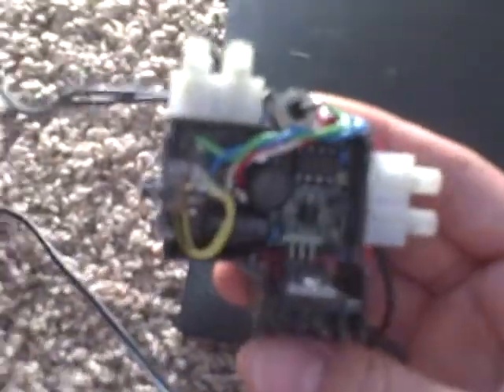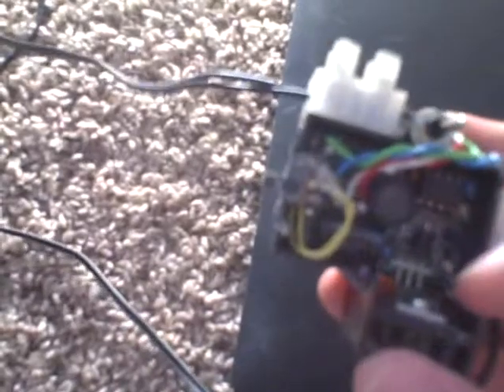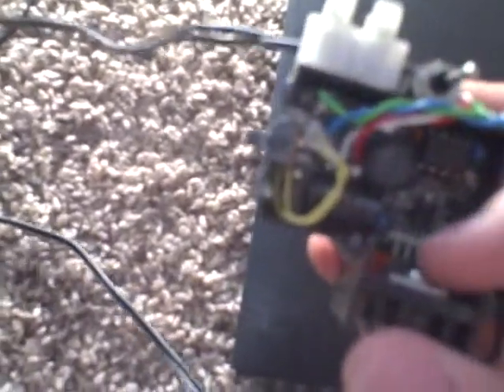And this is the driver I built, which I modified a bit. One thing I had to add was a heat sink to the power MOSFET because the power MOSFET was getting really hot — the diagram said it didn't really need one, but I would add one if you were to get one of these kits.